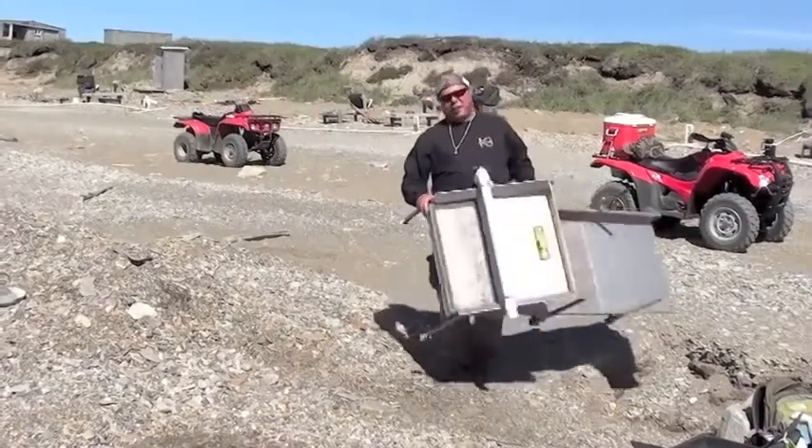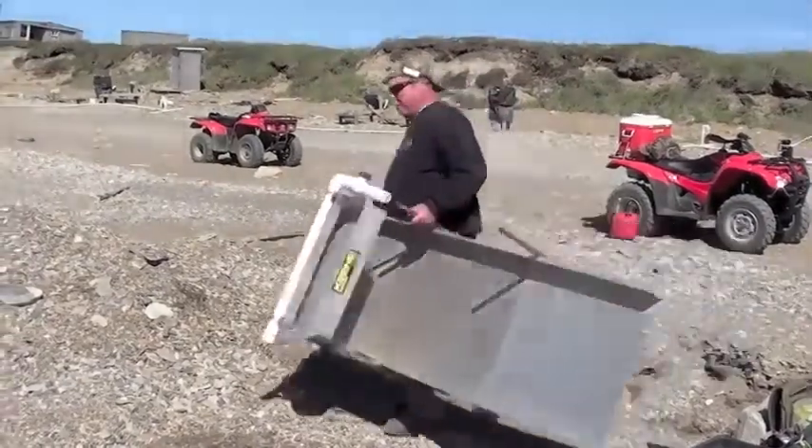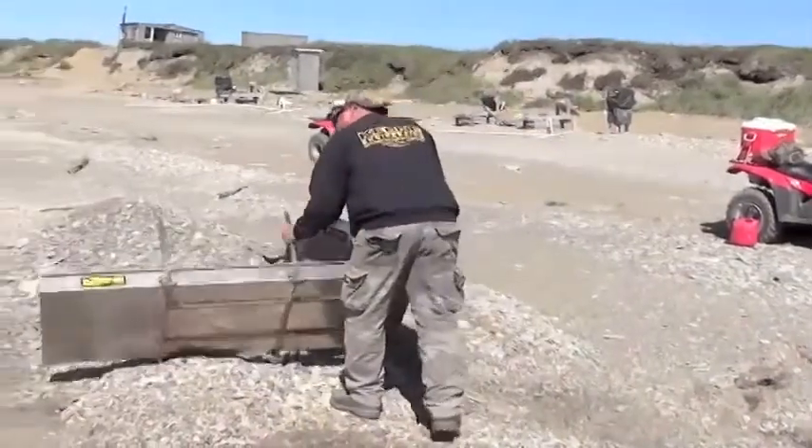This looks like as good a spot as any. This new Nome Beach Box is about 24 inches wide and about 6 feet long. We're going to adjust the legs and make sure that we got the right angle. With 6 feet of box, we need about a half inch per running foot, which makes about 3 inches of tilt on the box. I'm going to adjust the 6 independent legs and get it to the right level, then we'll start going through the whole process step-by-step.